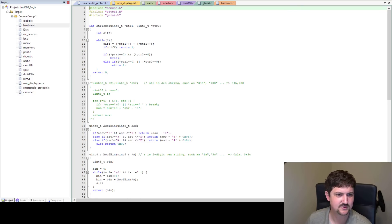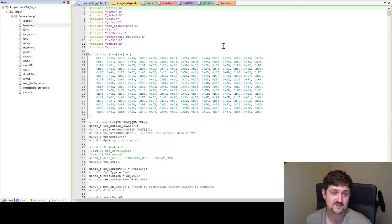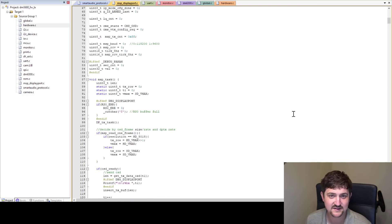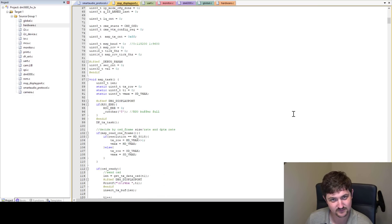So what can we do with this source code? We could customize the DisplayPort MSP DisplayPort code to pull in new protocols. We could do MSP VTX, where we control the VTX from MSP rather than Smart Audio, which is already being implemented, but it would be easier to maintain with the source code. It'll also be a lot easier for other companies making VTXs to add new camera support to the system. The things we can do with this might not seem obvious right now, but it is pretty interesting for the future.